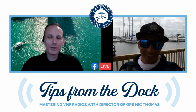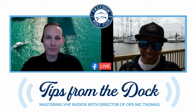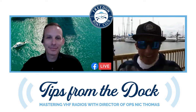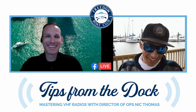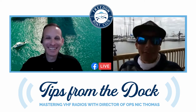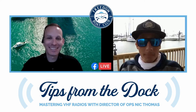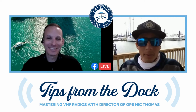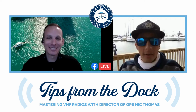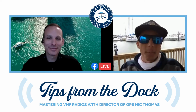So I know we're also used to Alexa and Google and our phones, but can you tell us a little bit more about how the VHF radio channels work? I certainly can. And you definitely can't say, radio, talk to so-and-so. It doesn't work that way. We have several different radio channels on the VHF frequency. Most are for ship-to-ship or commercial communication. Others are for ship-to-bridges, and some are ship-to-land. There's even weather channels to keep mariners up to date on the latest forecasts. And then, most notably, there's channel 16, which is always monitored by the U.S. Coast Guard, and it's for hailing and distress only. That's the big one that most everybody uses as their base point.